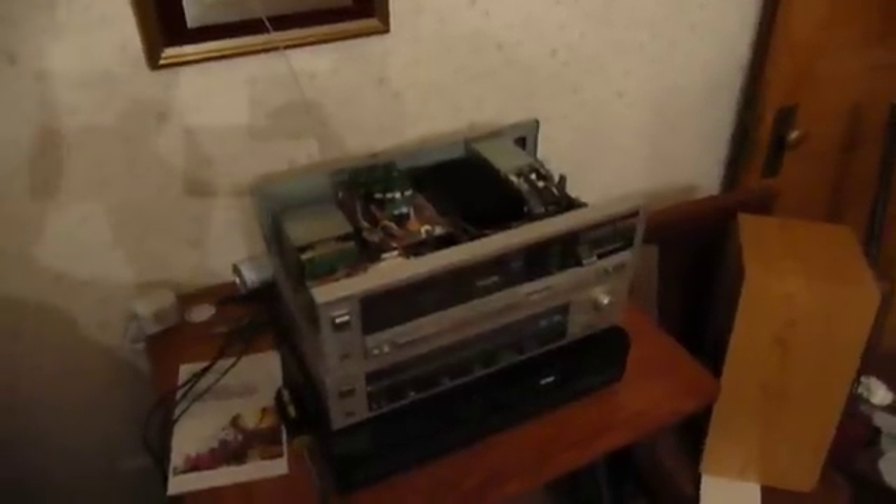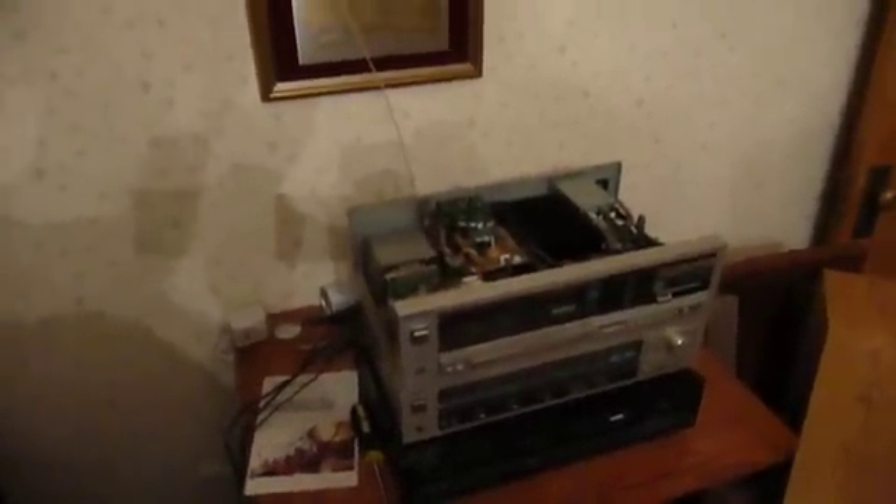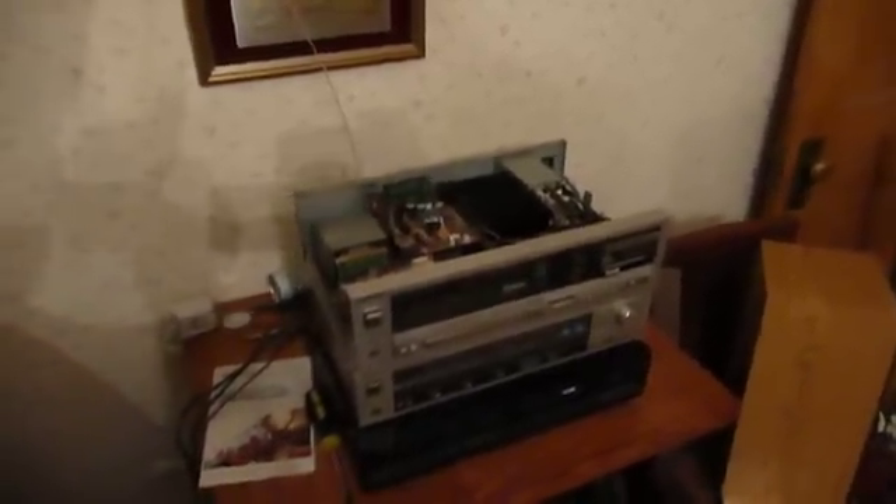I had the bad fortune that the speaker protection relay in the Technics SA-560 TV FM AM stereo receiver stopped working reliably — actually it hadn't really been working right since I got it. So I decided I was going to go in there and clean the contacts of that relay. Lo and behold, I broke the magnet wire coil on it. Then I discovered that although people had relays available for sale, they wanted an obscene amount of money, and I couldn't find an exact mechanical match. I found an electrical match on eBay at a price I was willing to pay, which was much cheaper than I could have bought it anywhere else.